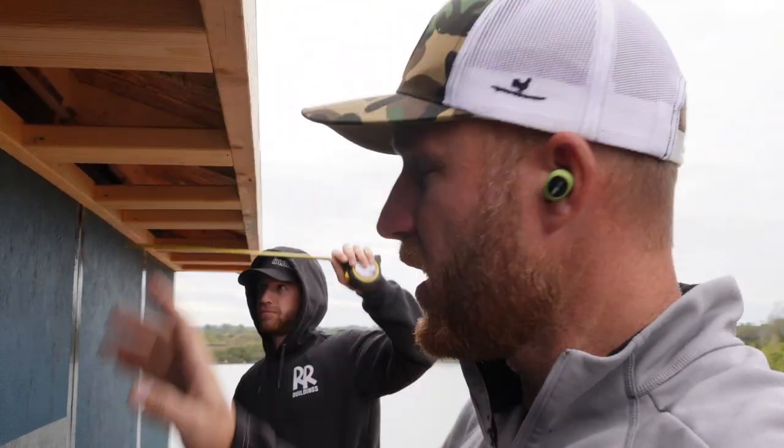In full disclosure, we are done with the front side wall and the end wall, but this side wall is the one that Greg and I know is not going to be perfect. When we were doing our trusses and putting on our overhangs, we started on the other side, made that as straight as possible with the string line, and then came over to this side and put another string line out instead of having an exact 16-inch overhang. So we're going to have to measure each soffit to make sure we don't cut them too big. Some people might call us hacks, but I think that's actually a smart thing to do because you never get trusses that are all perfect.